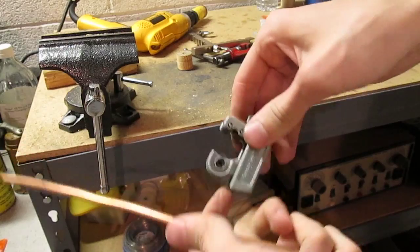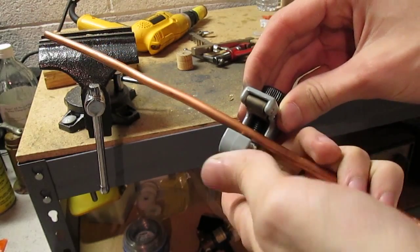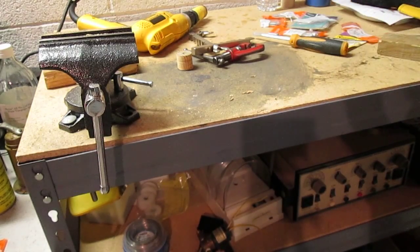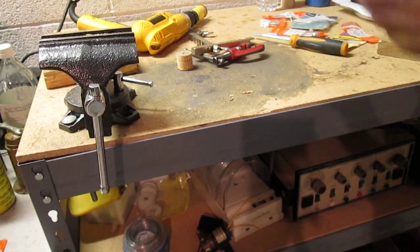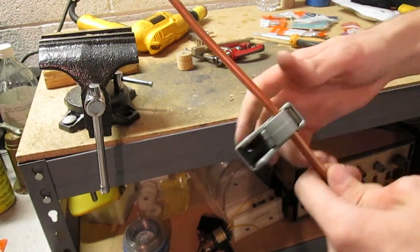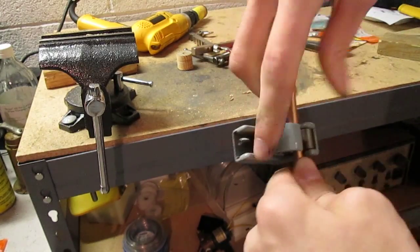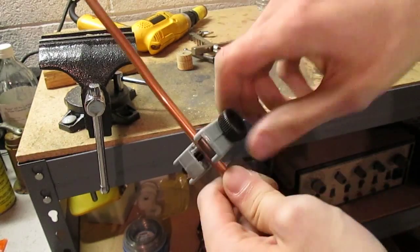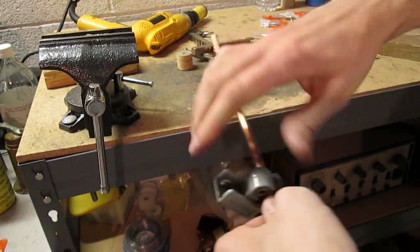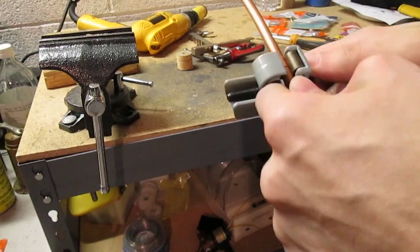And what you do is take a little pipe cutter, mark right there, like so, tighten that. Like I said, for absolute beginners who just don't know what in the hell to do, go get this pipe cutter, a mini one, about $5. What you do, turn it around a few times, it goes loose, like that. Then you just tighten it again, just a little bit, don't try and kill it. And just keep this little process up. So, eventually, it cuts through it.